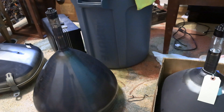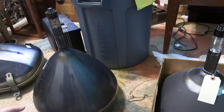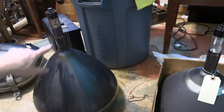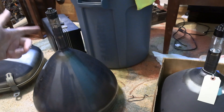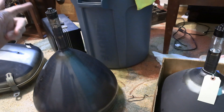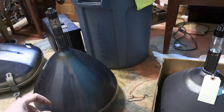The problem with that is when they pull the vacuum — when they suck out the air — there are always going to be a few molecules of air floating around inside, even with the getter. Those molecules get accelerated by the electron gun and smash into the phosphor, damaging it permanently. You start getting a brown spot that gets bigger and bigger, and it's very noticeable when watching TV. The early pre-war sets just lived with it — they figured eventually you just buy a new picture tube. It was such a new thing that that was acceptable.